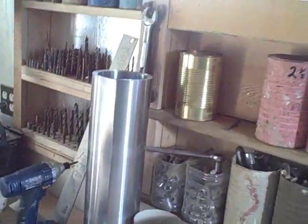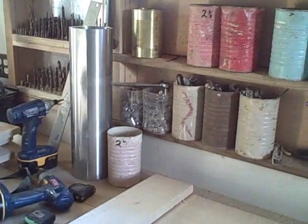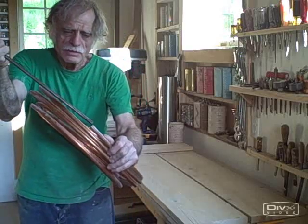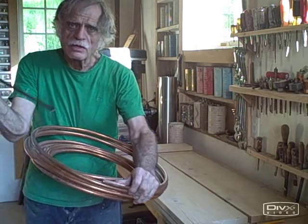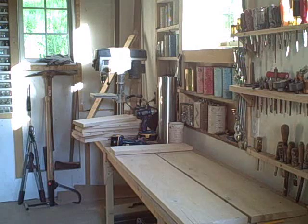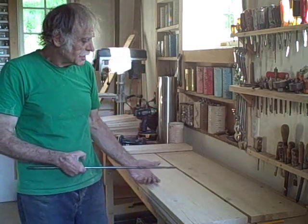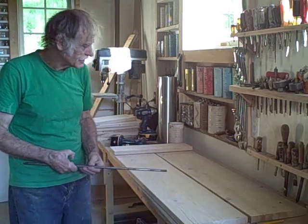This is aluminum flashing — it's a roll 50 feet long, 20 inches wide. For each collector, it'll take two sheets. This tube is 3/8 inch inside diameter, so the outside diameter is 1/2 inch. You might think we should use a 1/2 inch steel pounding rod, but it's better to use something smaller. I'm going to be using 3/8 inch pounding rods, and when the aluminum pops out of the groove, it should expand to approximately 1/2 inch.